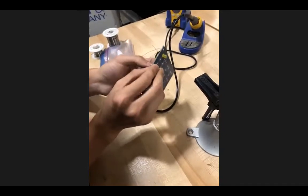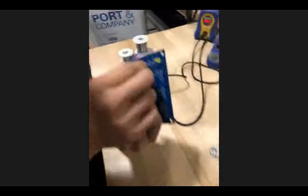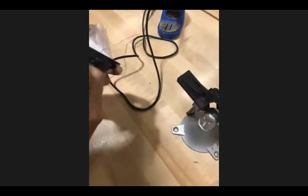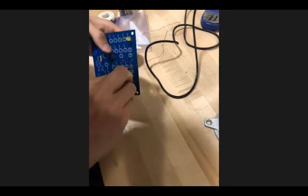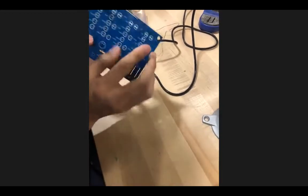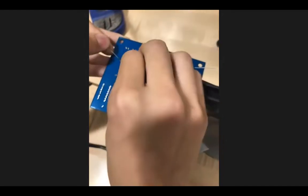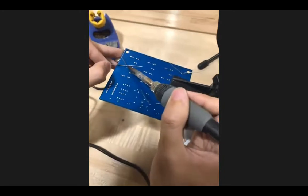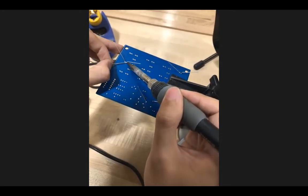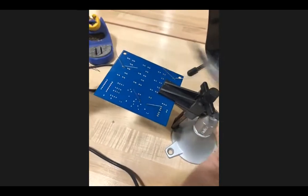All right, just one more example, and this one will be more specific. So I've put the LED in. I'm going to flip it over. Oh, actually, I have to do this side. Put it into the board, and I'll flip it over. Make sure you get this one. Now here, I'm going to reclamp it again, legs out, and I'm going to solder again: soldering iron first, then the solder, solder out, iron out. In reality, you only need a little bit of solder to make an actual joint.